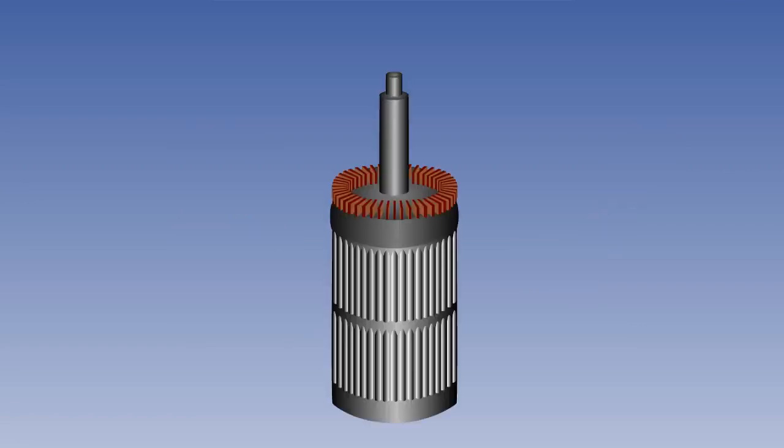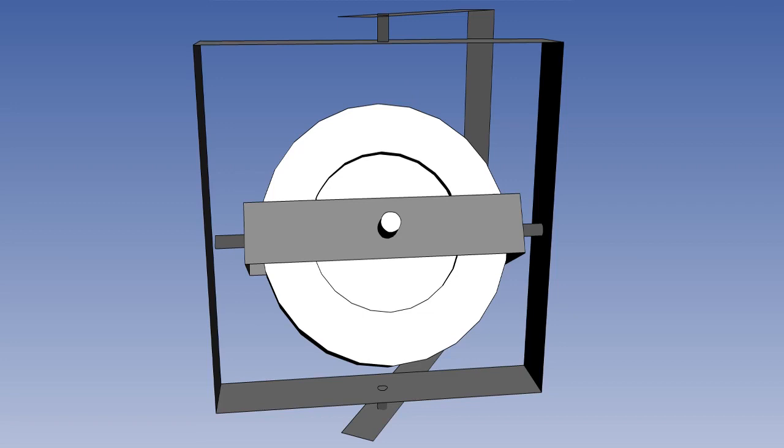The gyros used in INS spin at about 25,000 revolutions per minute, and some designs are quite heavy. Usually, we need a powerful motor to spin them. However, at startup they are static and so have no rigidity. The gimbals and gyros could be in any position. It simply depends on where they stopped when the gyro ran down after its last use. If we suddenly start these powerful motors without parking the gyro in a safe configuration, we could damage the gyro or gimbals.